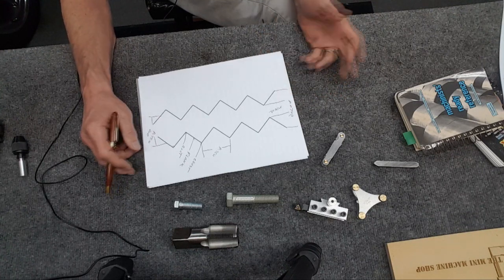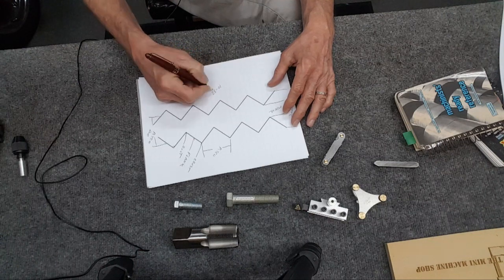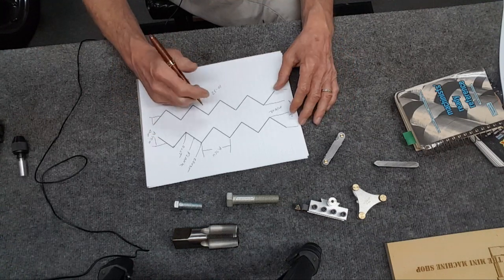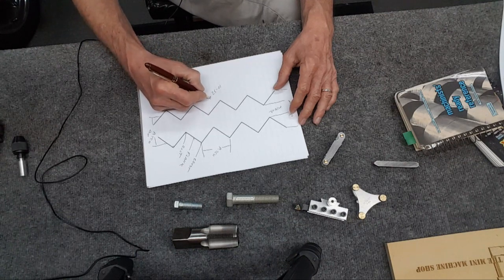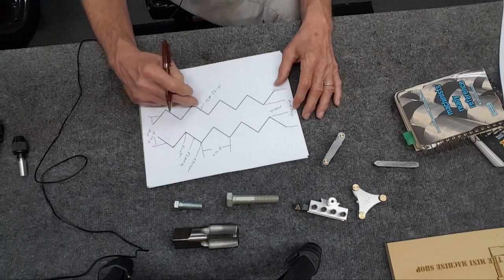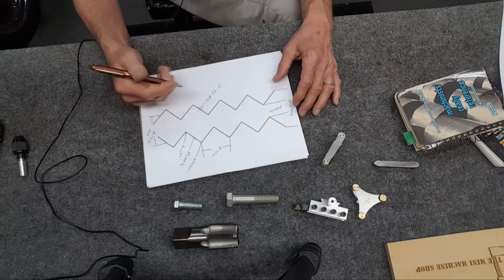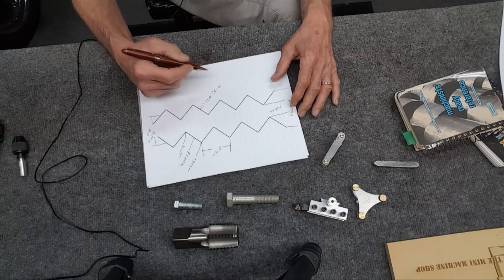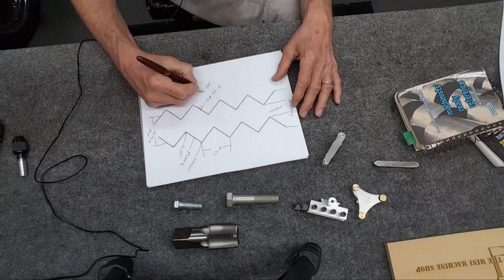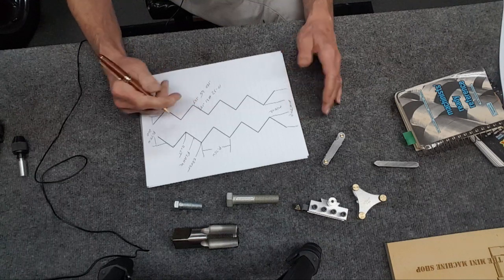But I did some playing around with it. For instance, a 1032 screw. If you're looking at tables, because they have a tap and drill calculator, in other tables you're supposed to use a number 21 drill bit, which is, what did I write, 0.159. I'm looking at their calculator, and all they want is tap diameter, which kind of blows me away. So I took a 1032 4 flute tap, measured it, and it's 0.190 outside diameter. I said, all right, I want a 65% engagement on the threads, and it says you're supposed to use a 0.164 drill bit.